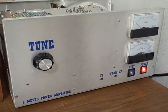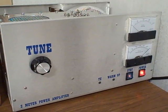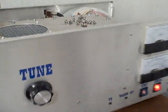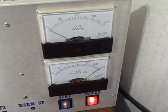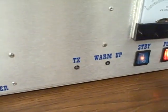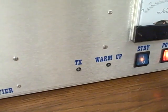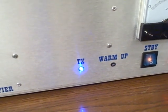All right David, good morning. Casey, KC5 GTT here. I'll give you a little video of your amplifier while waiting on the cover, which ought to be through today. Here you've got your metering for plate voltage, plate current, operation lights, and a warm-up light. Normally the warm-up light will glow red until it warms up, and then the transmit light is a nice blue.